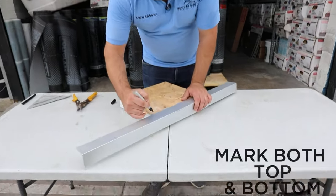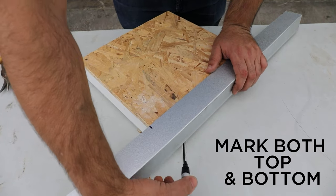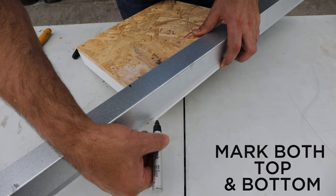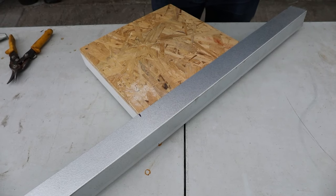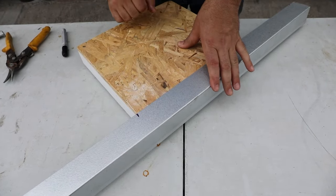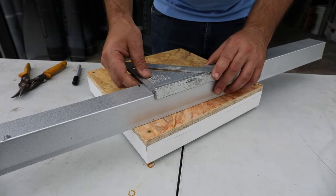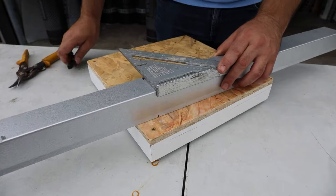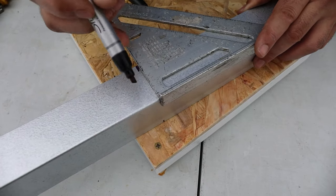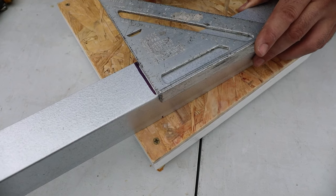The first thing we're going to do is mark it both on the top here and I also want to give it a small mark here at the bottom. The idea is to get a clean outside corner because this drip edge is going to be extremely visible. Once I've got this marked, if you're a beginner you can use a square to mark yourself a straight line. However, if you have years of experience like most of our roofers, they can just eyeball this and cut it by hand.